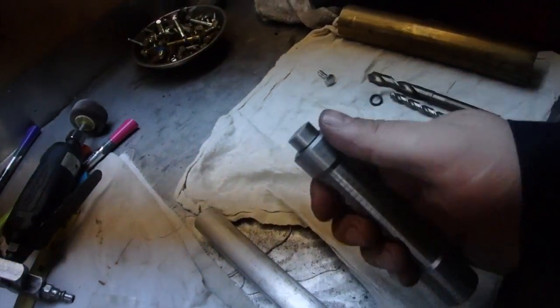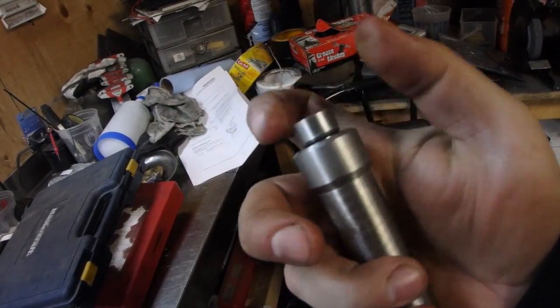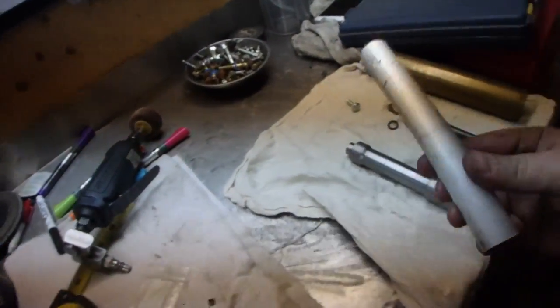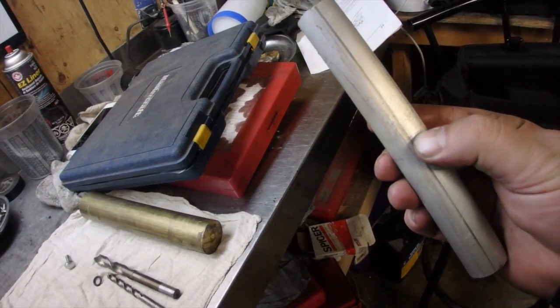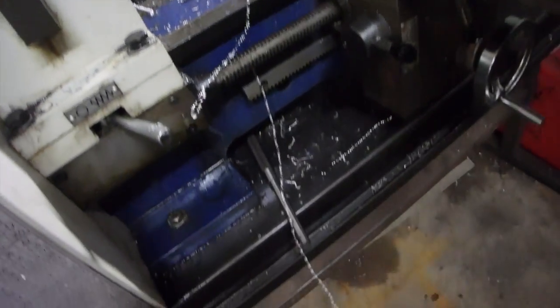Things are coming along quite smoothly. I did machine that round because I didn't want it looking square — so we got that part done. We're gonna leave this piece alone for now and start machining the piston. I've already made a line right there and I'm gonna cut it in with the lathe so I know how big the piston is gonna be. I'm on some pills so I can't drink yet — probably another week or two — but let's throw this aluminum piece in the lathe and start machining it down. Oh yeah, look at that long string right there.